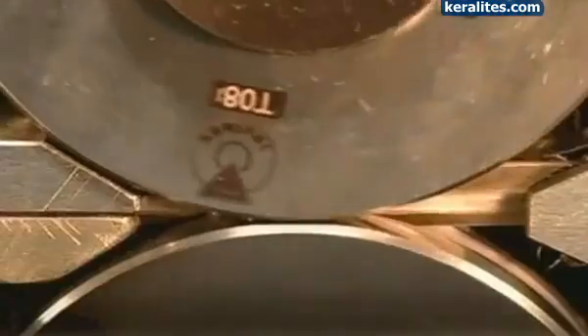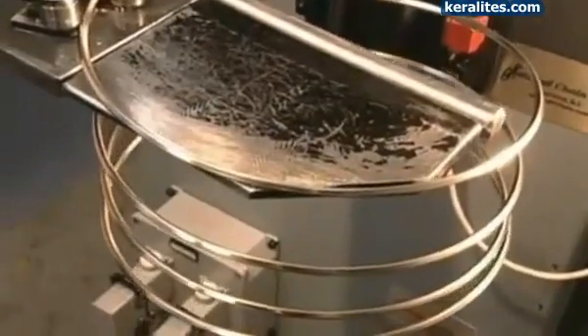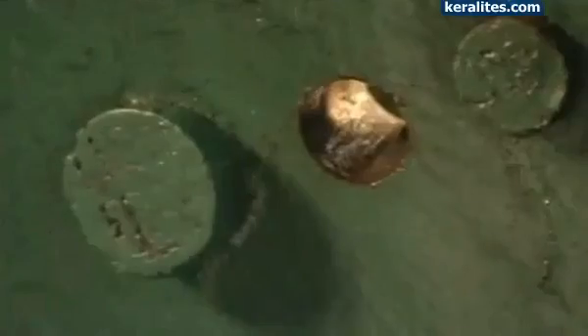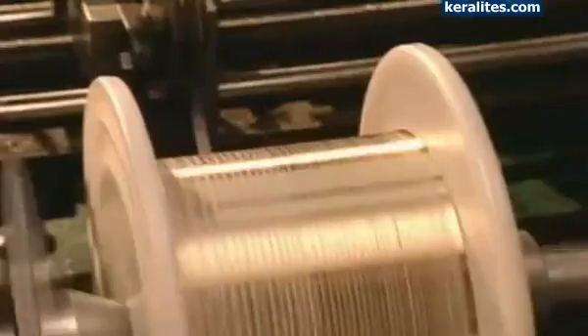The next stop is called a tandem mill. It has 12 rollers that stretch the rod until it's as thin as a piece of spaghetti. As it emerges, rollers shape the rod into a coil that's 24 metres long. The coil metal is softened in an oven. Then what's now a wire is uncoiled and continues to stretch as it's passed through a die lined with industrial diamonds. To prevent overheating, the machine sprays lubricant to cool the wire while reducing it to the width of a human hair, its final size.